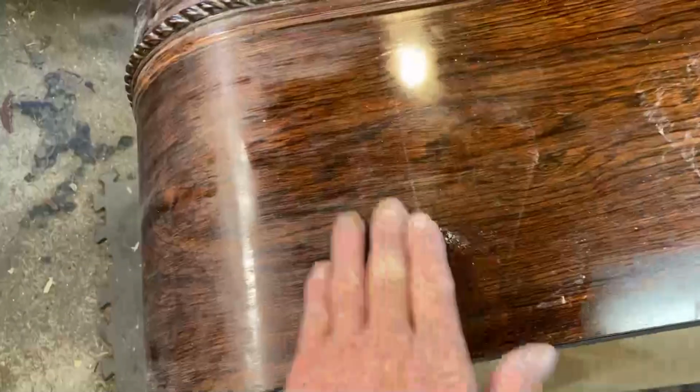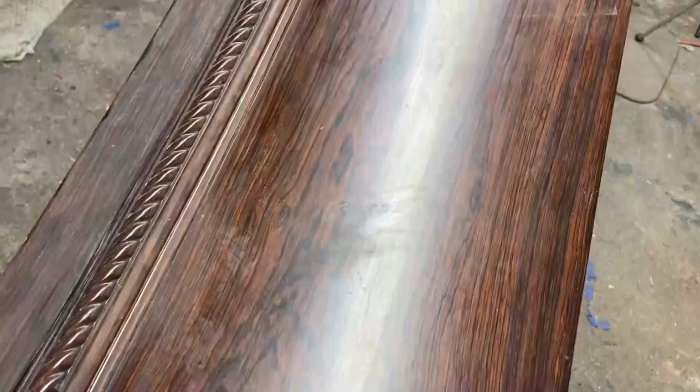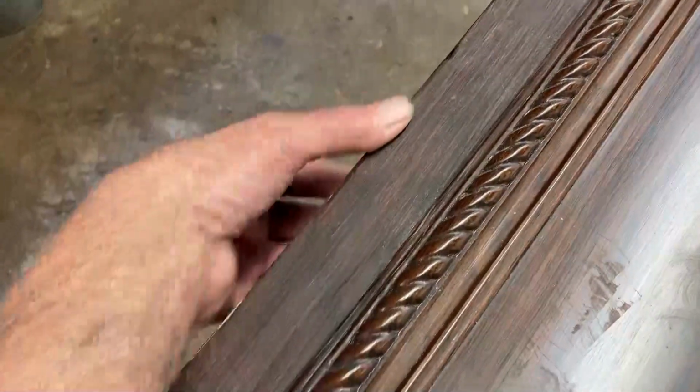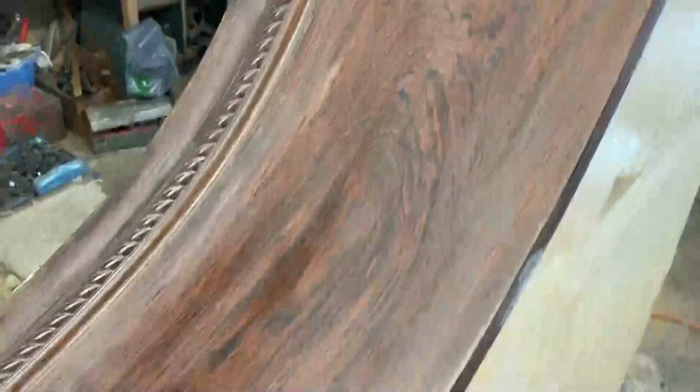Anyways, here's our surface that's coming along. I don't know if you can see it. Maybe. Sanded it down here. These low spots have got to stay. I'm going to try to build them up a little bit. But overall, it's coming out fine. Here's some of those, maybe a couple spots over here. This one. I can fill with that hot knife. I can do that anytime, even after the finish is on completely. That's what that's for. The boo-boo fixer. Okay, we're gonna hit it. Continue sanding it here, and then I'm gonna shellac it.